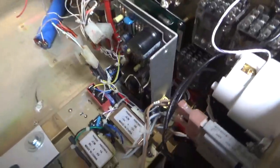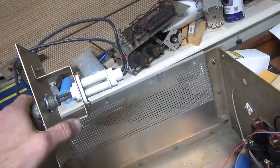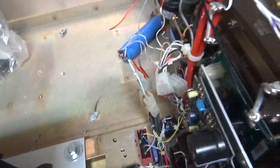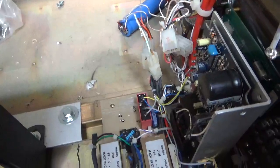This is it in the cabinet. These connectors are for the blower/soft start delay board. Plenty of clearance. The high voltage cable assembly is right here — that unplugs. That's called an Alden plug. There's plenty of clearance for that and plenty of clearance for the blower. That's why it's mounted to the cover. Drop it in and look through the hole back here to make sure you've got the proper clearance.